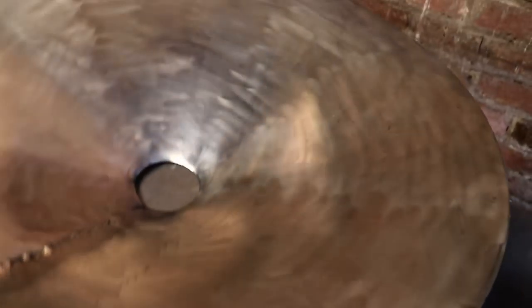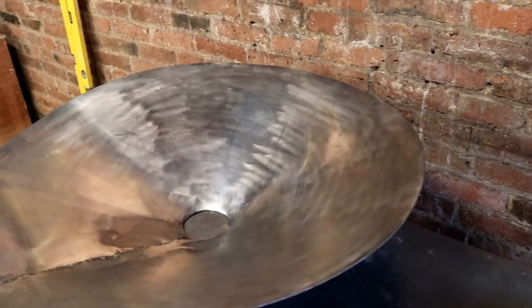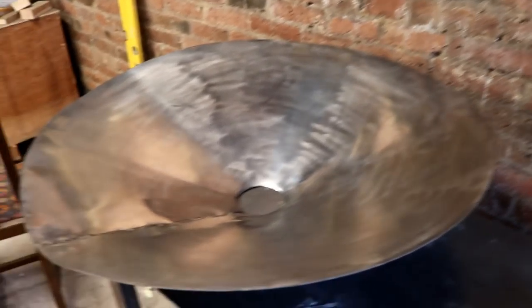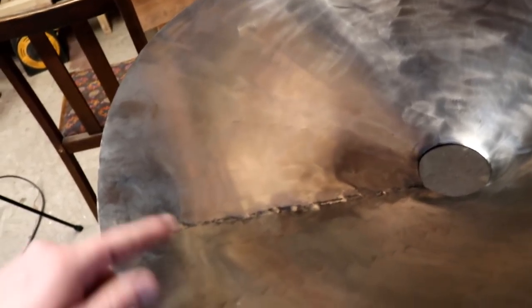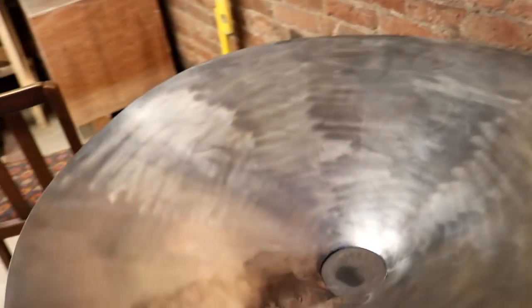So, honest opinion, my final thoughts are, unless you have to do it, like I have to on this, don't bother. It's a lot of time and expense wasted, I think. But unfortunately, I'm going to have to polish on the inside of these because this weld isn't going to be suitable like that. Now, I'm looking at it and you can see it's managed to trap a lot of the polishing compound in the edge. So I'm left with no choice but to revisit this. Whether that means reflowing or grinding, it's back to the drawing board because I want it to be uniform all the way down there.